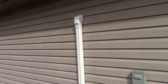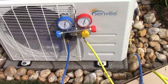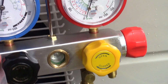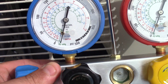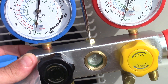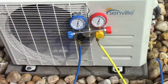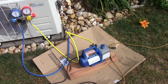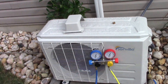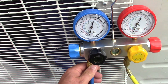We have this thing vacuuming the air out. If there are any issues, you don't have to worry about losing refrigerant because we haven't released it into the system yet. Looking at the low side meter, we're trying to get down to negative thirty inches of mercury - and I'm already there. The manual says negative twenty, so we're in real good shape. We're going to run this pump for fifteen minutes, and just be sure if you get a pump, you add oil to it because they come without oil.